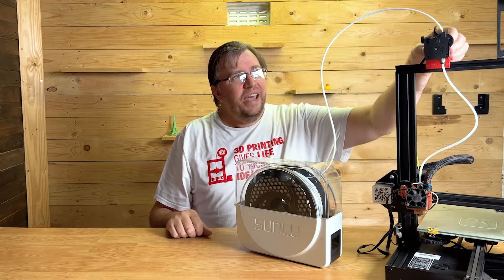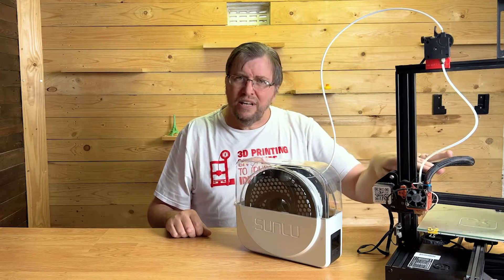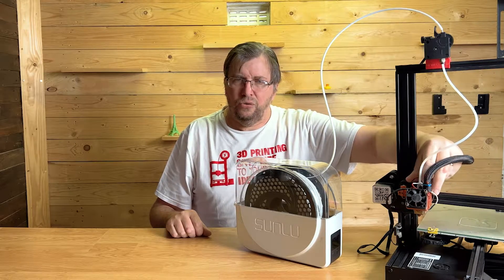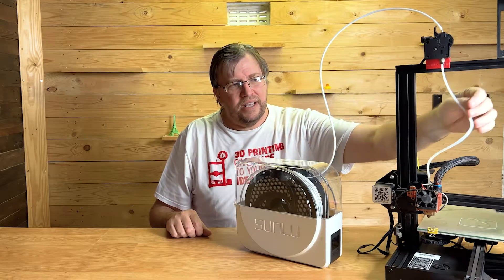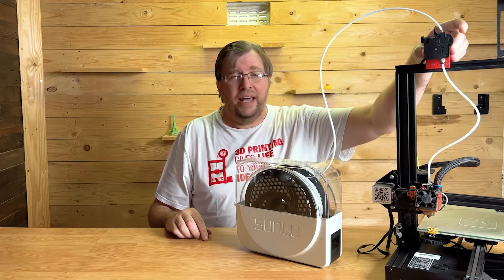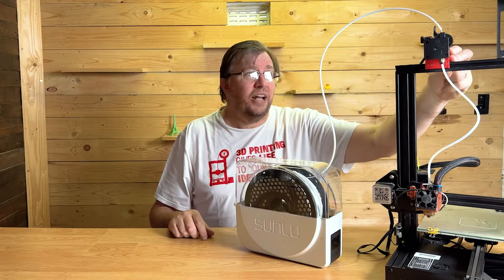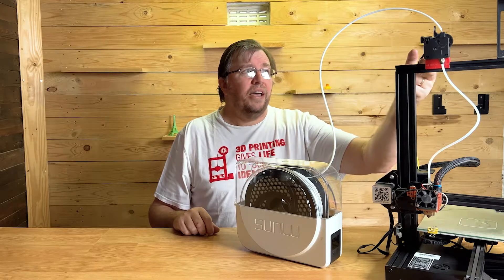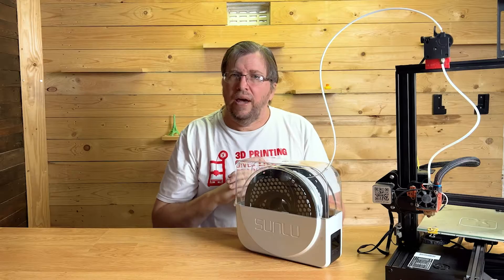Now for tip number two. I've mounted my extruder on the top gantry of my printer rather than on the gantry arm, because having it on the arm puts extra weight and tension on your print area. Moving it to the top gantry relieves all that pressure and works beautifully — you get a nice clean filament flow down to the bottom. I do this on all my printers as soon as I get them. I'll post the STL for this bracket in the link in the description so you can print it and try it yourself. To run the wire, just route it around the back through the aluminum extrusion, and I've used blue rubber fillers to hold the cable in place — it doesn't get in the way and runs beautifully.